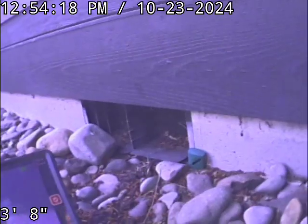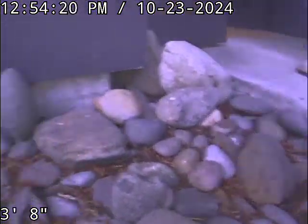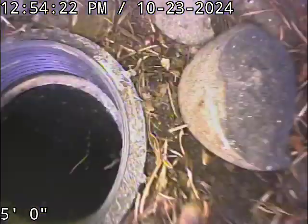We're located just to the left of the front doorway. I describe everything as if you're standing in the street facing the front of the house. We have a 3-inch ABS cleanout that sits pretty much perfectly halfway between the first foundation vent and the concrete patio to the left of the door, should you lose track of it.